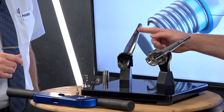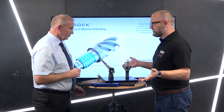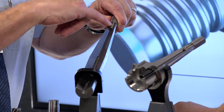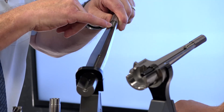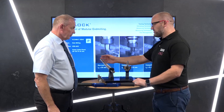So the third contact — face, taper, and now a third — how much better is three than two? It's much better because generally you've only got your contact at the top and that's where your bending moment is. By extending that contact out, any forces are spread across the whole length rather than just at the top.